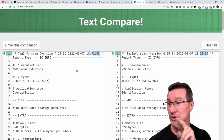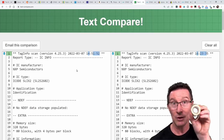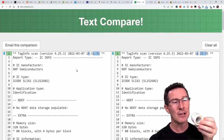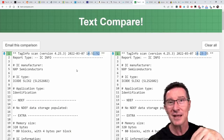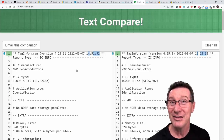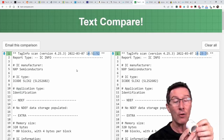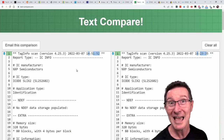I've got two results. The one on the left is the original straight out of the box before printing anything. Then I put the paper in and advanced it by one — I wanted to check if they actually write to the RFID tag. Could you just buy one genuine roll, unroll it, rip out the RFID tag, and stick it on a new roll so it always thinks there's a new roll there? Unfortunately, they've thought of that. They write to this RFID tag, and it counts the number of labels. It comes pre-configured with the number of labels on the roll — this one had 50-something. Once it gets down to zero, you can't use that tag anymore. The bastards.